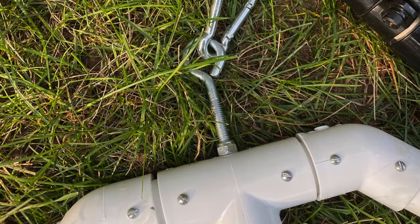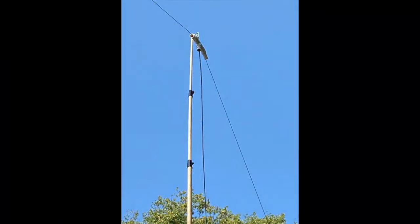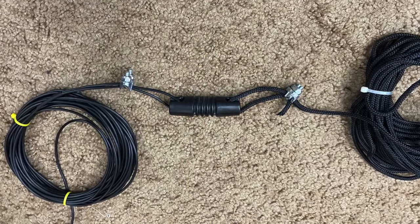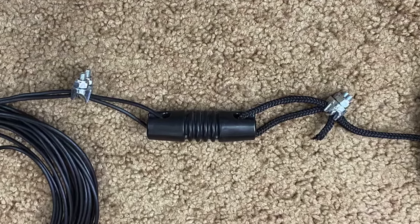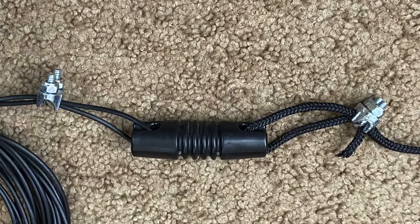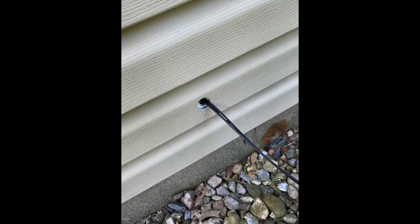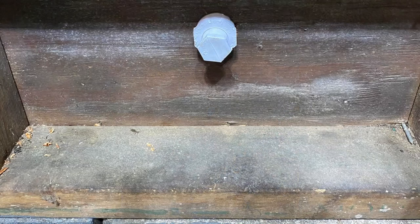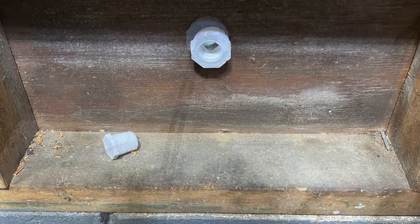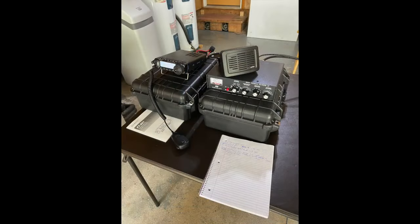The assembly is simply connected to an eye hook on the top of the fiberglass pole and then each section of the fiberglass pole is extended into the air. For this example, the highest point of the antenna is at about 33 feet from the ground. The 27.5-foot antenna radiating elements don't reach all the way to the ground, so insulators are used on the ends. One side of the insulator attaches to the antenna radiating elements; the other side attaches to nylon rope which is secured to the ground using doggy leash yard tie-downs that screw into the ground. The ladder line comes into my house through a hole in the siding, which I cover up with a hole plug when not in use. On the inside I found a PVC fitting which I simply screwed into the wood header — it has an OD of one and a quarter inches with a one-half-inch removable center plug. The ladder line leads into my garage where I can operate on a temporary basis whenever I choose.